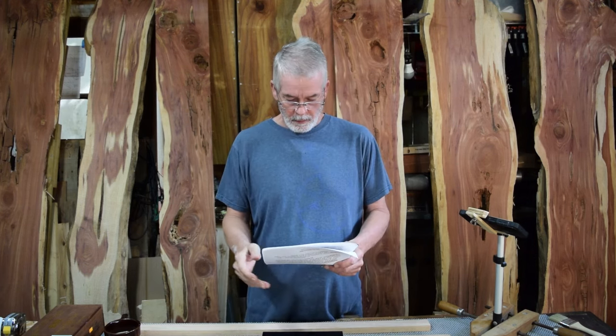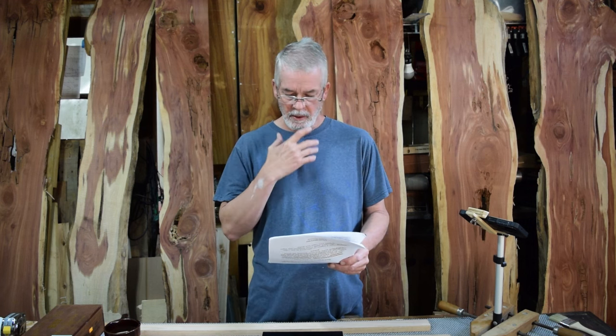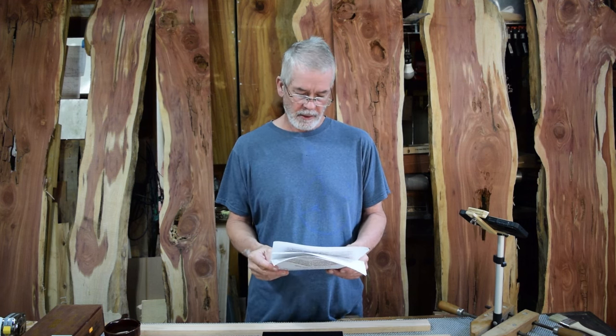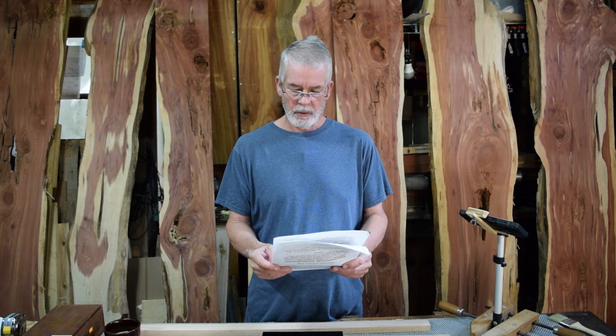If you've been following along on the videos, you know the last one to come out was the piezos and capacitors, and it's gotten a lot of views — thank you. It kind of tells me I'm not the only one going down this path. Two comments I want to share. First from Andrew: the source impedance of a piezo pickup is entirely different from that of a regular magnetic guitar pickup, so the capacitor does not function like it would in a regular guitar tone control.